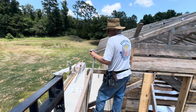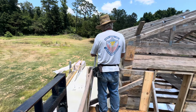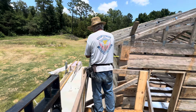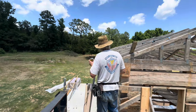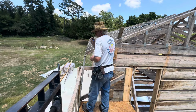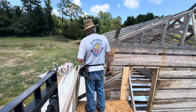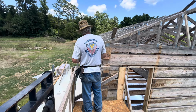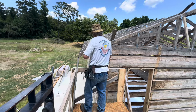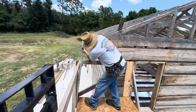That'll give us a little space on us. It's what, 22 and a half normal? 23 and a half total, so I'll make it at 22 for the cutoff. And then just in case we have a bad tail or something, we'll have a little bit more adjustment there. If you bring that camera over there, Grandpa, explain how you're setting that up to get a 4/12.